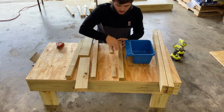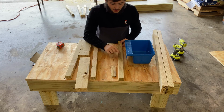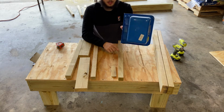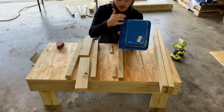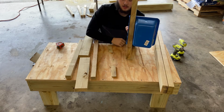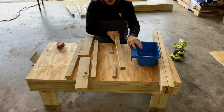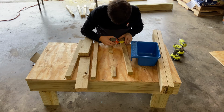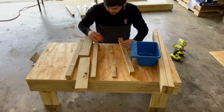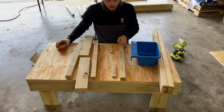Once again, this is 2 feet long, and of course that's because of the width of your stand. So it's 2 feet long. Now the width of this depends on this gapping in here. Now to get a snug fit on this guy, okay, and I'm not holding that, so that I like that snug. That measurement came out to be 1 5/8 of an inch. 1 5/8 of an inch wide by 2 feet long. Okay?